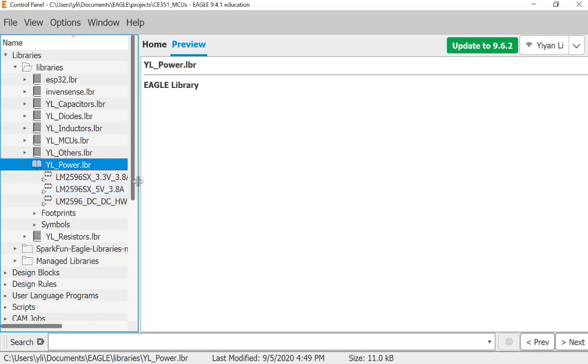So what you actually want to do is manually short that pin, the plate pin, to the ground, so in the layout it will be shorted together in the future. I'm going to show you in the PCB video. This is just to let you know how to fix the problem in the layout and schematic of the LM2596 device. Okay, we'll see you in the next video.